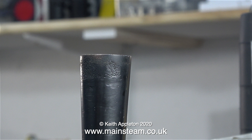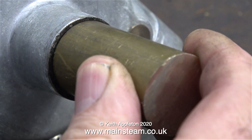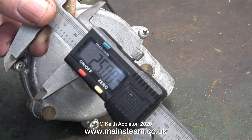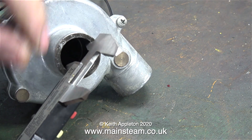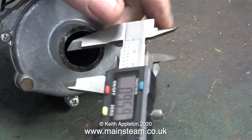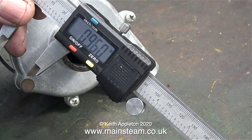I think it's a much better idea to raise the steam without the cap on and then fit the cap once the blower has been removed. I'm going to make an adapter using this piece of brass that will make it so the blower sits on top of the chimney. The brass is currently too big. The chimney is one inch in diameter, and here I'm checking the diameter of the hole in the blower using my digital caliper — the hole is slightly less than one inch.